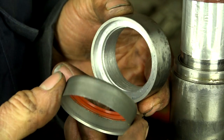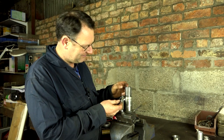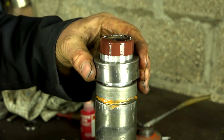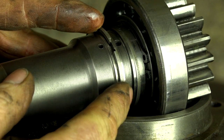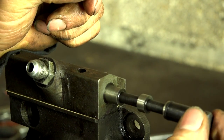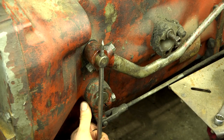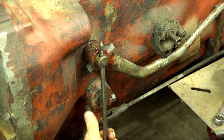I would suggest looking at replacing the seals. The seals themselves are very easy to damage while you're fitting them, so we need to use the best method we can to replace them. We also look at the multi-power oil shaft seals and the multi-power control valve — all jobs that you want to do whilst the tractor is split.